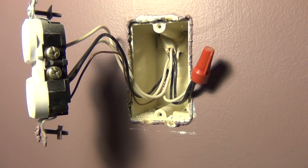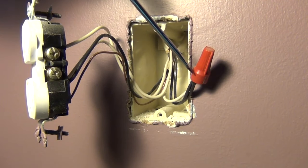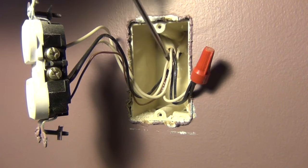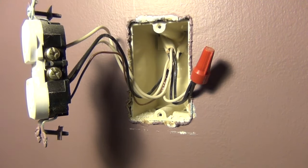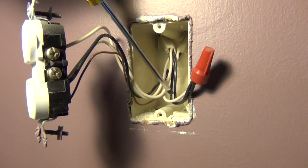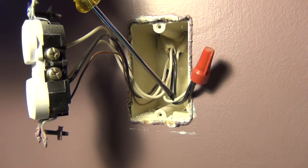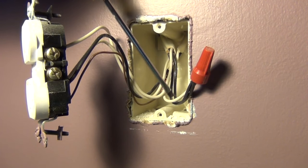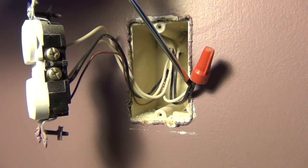Taking a look at the junction box at the outlet — here's our outlet, and we have this wire nut over here with two blacks coming in and also a white. These two black wires come into the box: one is bringing power in from the source — maybe from the panel or another outlet — and the other black is the feed out to the next device on the circuit. The white wire under the wire nut is supplying 120 volts — the hot leg — up to our switch. Again, the electrician should have indicated this is a hot wire by wrapping black electrical tape around it, because it's tied into the two blacks under this wire nut.